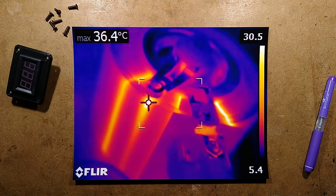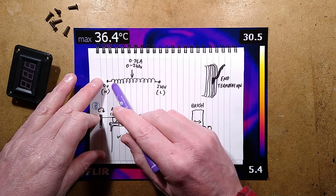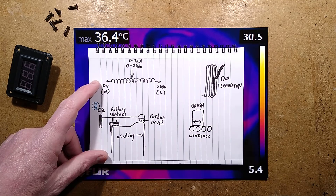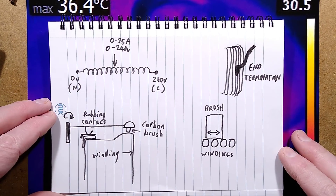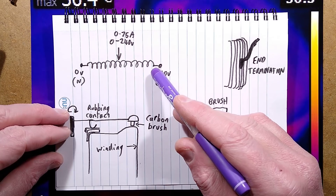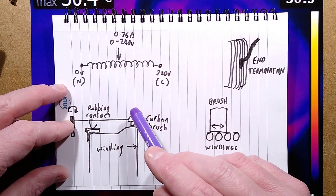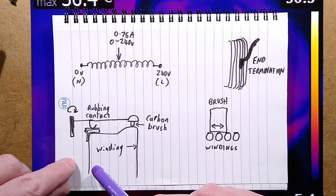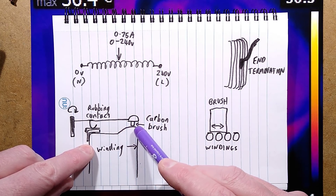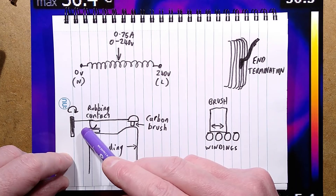Let me bring in my notepad. This is typically the sort of layout of one of these things: it's a transformer with a winding, with zero volts neutral at one end and 240 volts at the other. You have a sliding contact that can slide along that transformer from zero up to 240. You could use a rheostat or a resistor, but they tend to get very hot — this being a transformer doesn't, although it is limited to that quite low current. As this brush rotates around, the shape of the windings is quite odd — they've been wound around and then pressed into a shape so they rise into a little peak that comes up to the carbon brush and then duck down. When they duck down on the inside of the toroidal transformer, there's an insulator over the edge — an insulating bush.